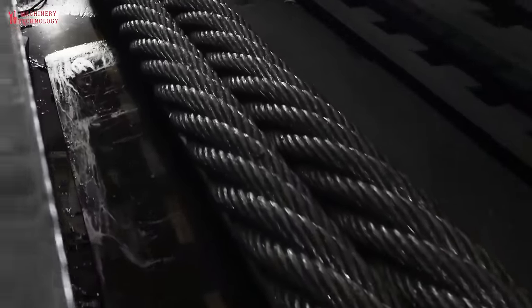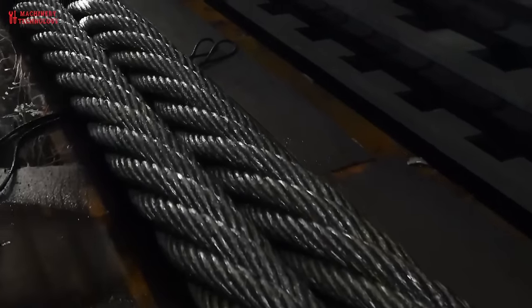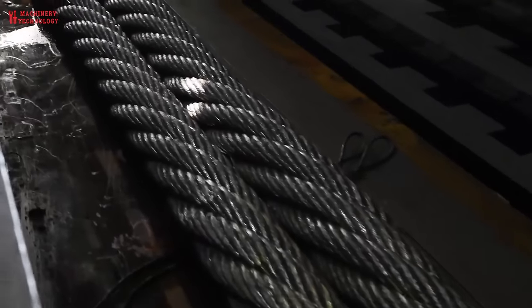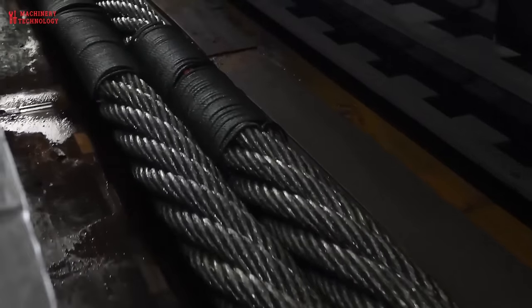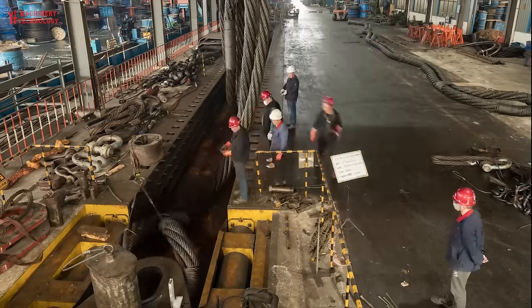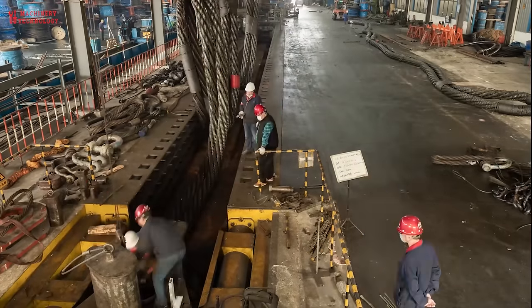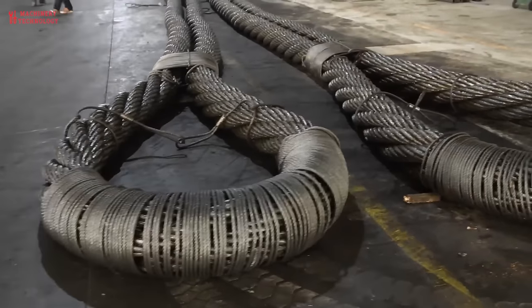Proper care for wire rope. To ensure that your wire rope quality remains high, you must regularly inspect them for wear and degradation. The right wire rope should be selected for a particular use. Watch out for performance impacting damage like rust, fraying, and kinks. To make sure that they stay in tip-top shape, you should also clean and lubricate them as needed. Check for this need as a part of your regular inspection.